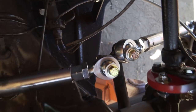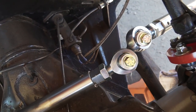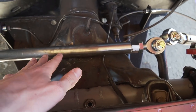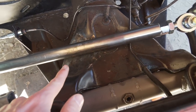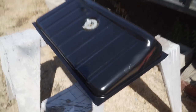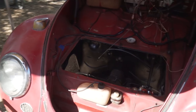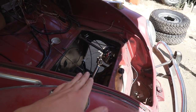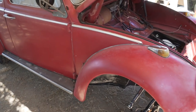The other issue I wasn't expecting is that the holes for the old steering are wedge-shaped and really hard to drill out - with a half-inch drill bit I barely dented them even after spending some time on it. The metal is super hard so I need to figure out how to get those drilled - that's what I'm more worried about. Cutting and rewelding a plate isn't too bad, so I'll start with that today. The gas tank is all painted and looking brand new - really happy with how that turned out. Scotch-brited the cap and masked it off. The main hurdle today is getting the steering sorted. I'm going to jack the car up and put jacks under the body before cutting that section, just to be safe.